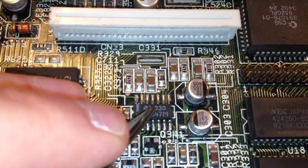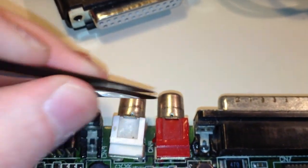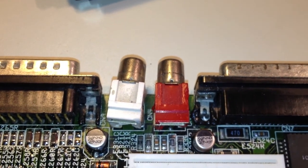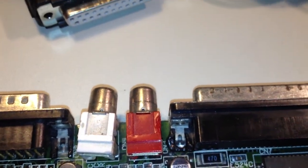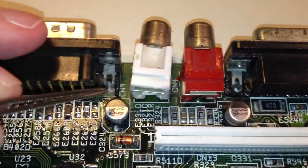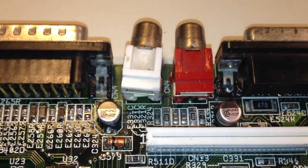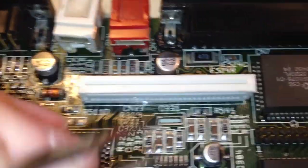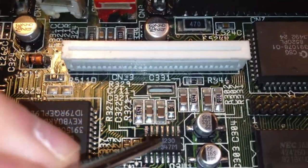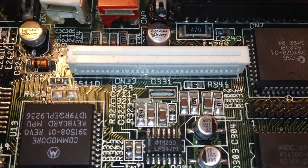You know what I think? I think the engineers at Commodore decided to configure these op-amps to have a gain that is quite high. And that might not be good, because not only will the audio coming out from these two RCA jacks have an amplitude that might drive some TVs into distortion — outside the operating range of the amplifiers in the TVs — but also these two AC coupling caps are getting a little bit reverse biased sometimes. We could see that on the scope — the swing went under the zero volts line — and that is because this op-amp is configured with too high a gain. I think Commodore realized their mistake later.